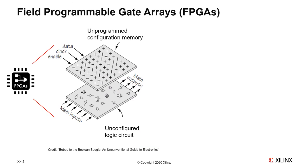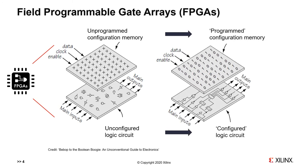If you're new to FPGAs, this diagram from a book called Bebop to the Boolean Boogie is a good representation of how an FPGA works. An FPGA is essentially comprised of two planes. The upper plane is the configuration memory; the lower plane is the logic circuit. If the upper plane is uninitialized, it contains random data and the circuit below is not configured. If we load a design to the configuration memory, it sets up the circuit we want on the logic layer — selecting the logic gates and making the right connections between them. This is a little bit like building something from Lego. By loading a different design to the configuration memory, we can have a completely different circuit implemented on the logic plane.